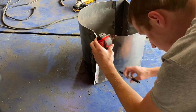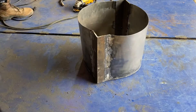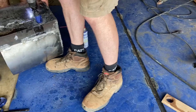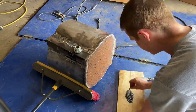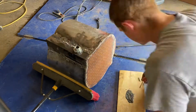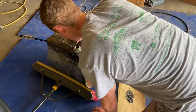Next I'm marking and cutting the hole for my burner. I used a pipe union so I could unscrew the outside part from the inner part of the burner, making it easier to store. I couldn't weld the union to the angle iron since it's cast iron, but I used metal epoxy which should hold up to about 540 degrees Fahrenheit. I think that should be plenty on the outside of the forge, but if this doesn't work I'll replace it with something else.